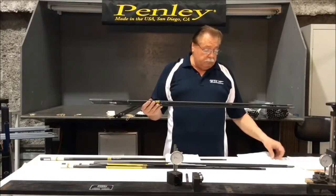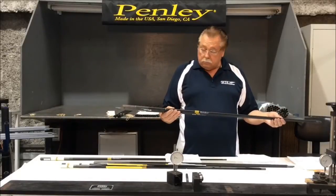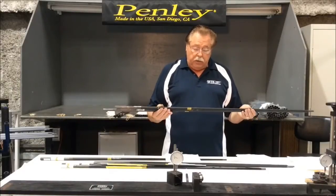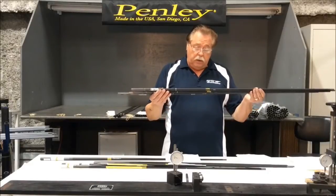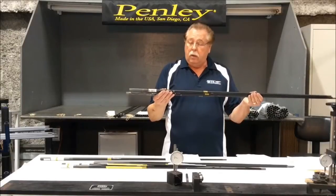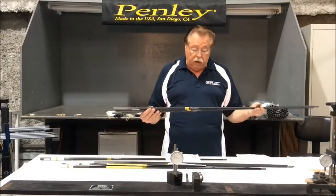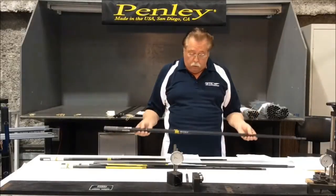He picked these up on a website, internet, and the graphite light R's are actually G285 R flex. They're actually flexes at S. The butt ID is about 525 on these guys. And again, they went down on the ID, so they tried to add material, and that increased the moment of inertia, MOI there, and increased the stiffness. These look very close to what I have, but they were made on a different mandrel. The butt diameter was different. The weight should be 80 grams, but these things weigh about 84.